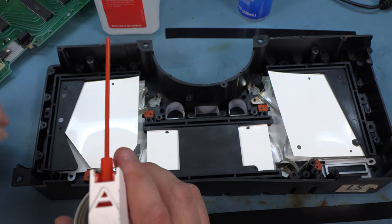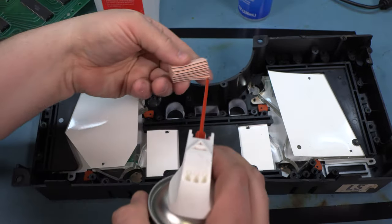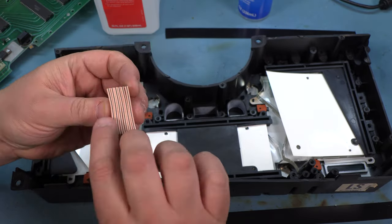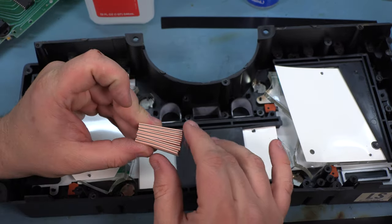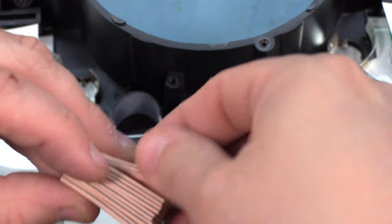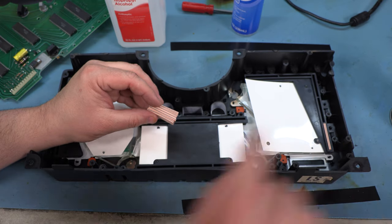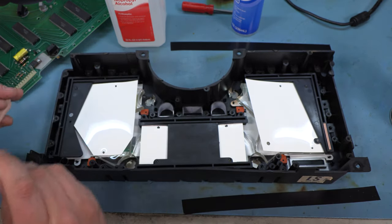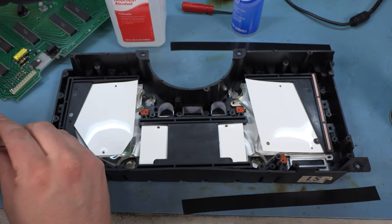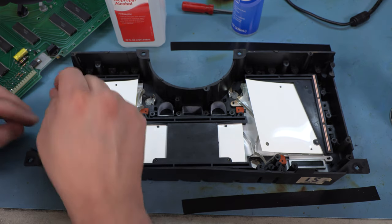Next we'll take and stack all of the short elastomeric connectors — there are six of them. We're just going to clean the ends of those. Once they're nice and clean, we're going to look at each of the four ends of each connector, and we're looking for a very slight hook shape. I see the hook shape on this one — the hook is pointed up. We're going to install it such that the hook is up and in that specific location. The rest of these can be installed in any orientation you want. One thing I try to do is make sure that they are floating freely in these plastic trays. If they're not, just try rearranging them.